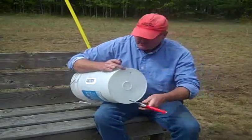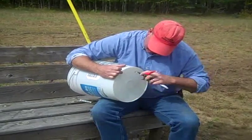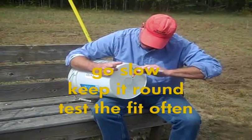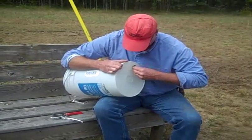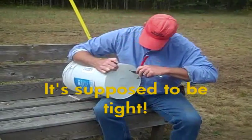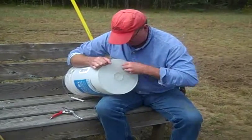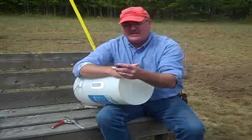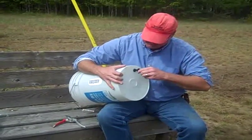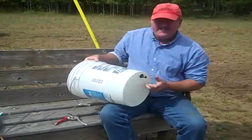As I get close to the finish size of the hole — it's still a little small, but I'm going to keep testing it. I'm going to keep trying to push this grommet in, because I don't want this hole any bigger than it absolutely has to be. I'm keeping it round all the time. Now the rubber grommet fits in there — it's pretty tight. But the beautiful thing is that when I push this plastic piece in, that makes the grommet even tighter. And now this thing does not leak.